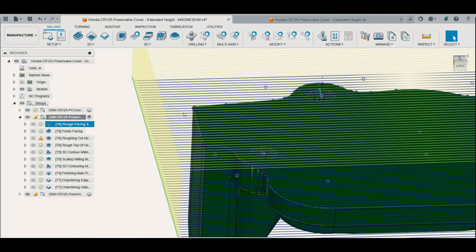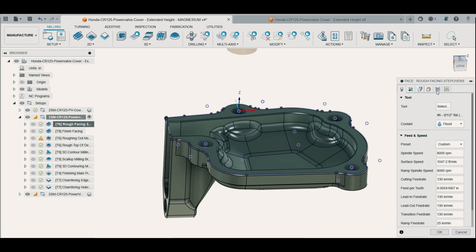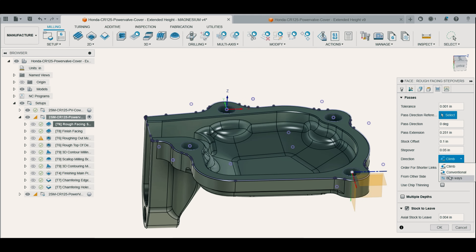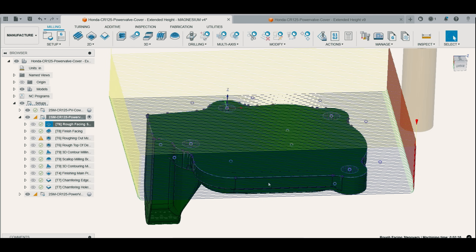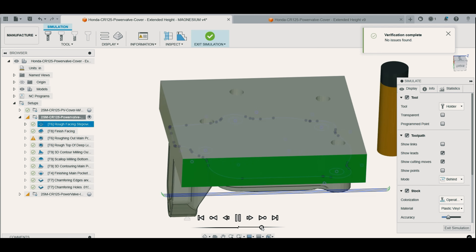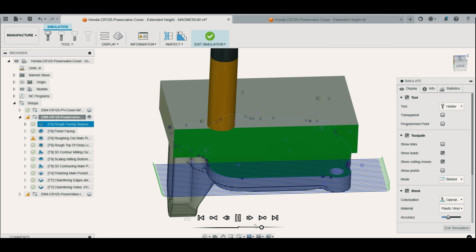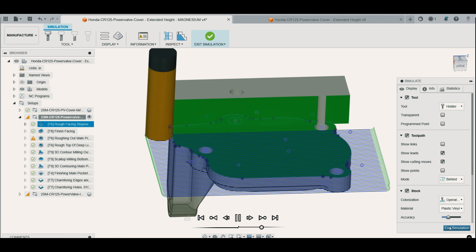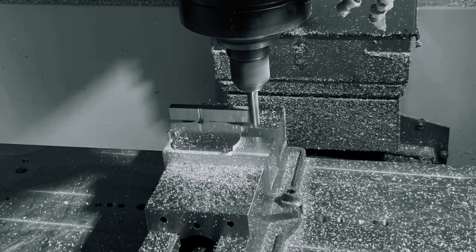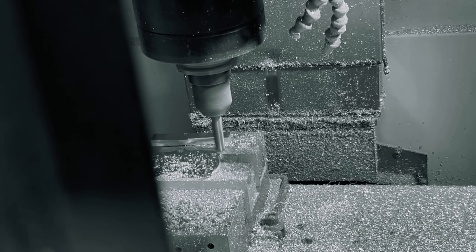For Op 2, I left all toolpaths basically the same except for the initial decking off of remaining stock. With my half-inch roughing end mill I reduced feed rate and decreased stepover distance to lower tool pressure, keeping the part from moving in the jaws and reducing heat running dry. On the prototype I had the end mill roughing in both directions — climb and conventional — but on the magnesium the last conventional pass would cause remnants to sling and fly into my machine's side window at Mach 3. I changed all facing passes to climb and everything went fine from there.